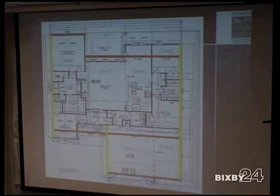Well, the main thing is they need to identify that brace wall line. In other words, out there to the side, you're going to put brace wall line 2-1. And then you're going to put either gypsum board, or continuous sheathing, whatever you're using to brace that. And that calculation has to be on the most restrictive, okay? In other words, if you're using continuous sheathing, you have to use all continuous sheathing. You would have to put continuous sheathing across the backside of the garage. But if you can get enough bracing there, you may be able to go gypsum board, but it's going to ask for 20 feet of bracing, where the continuous sheathing may only ask for 6 feet, okay? But just mark that you want this much gypsum board, we need this much footage, and then we just see that you get that much.